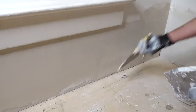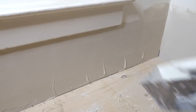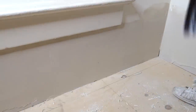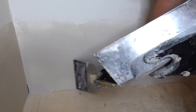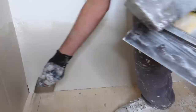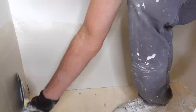I'm taking the opportunity to flush this up a little bit. Instead of just embedding the tape and walking away, we can make this flatter so when the time comes to install baseboards it's really nice and flat — just giving us a nice head start. Let's get a little more in that corner. That's looking good — leave it alone.